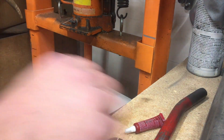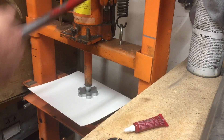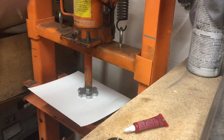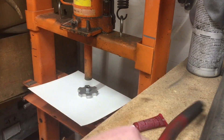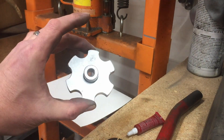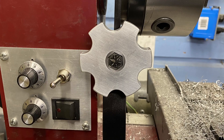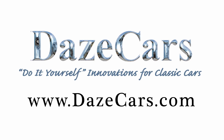If you're wondering why I put a piece of cardboard underneath the knob, it's simply there to protect the finish. Once I get the socket seated in the center hole of the knob, I like to do a couple of really small presses just to make sure everything is sitting nice and tight. I don't want to just reef on it as that will smash the aluminum, but I do definitely want to make sure everything is snug. I am extremely happy with how that came together. Here it is installed on my spindle lock — not only does it look a lot better, it functions way better as well. If you like what you've seen, please click like, subscribe, and hit the notification bell.